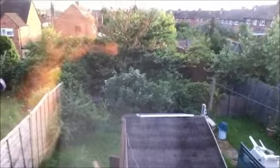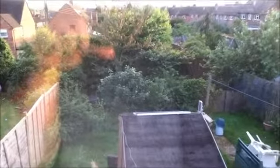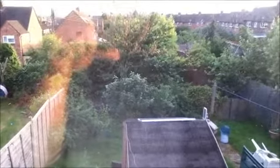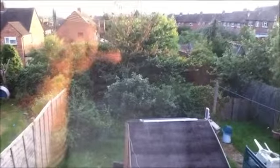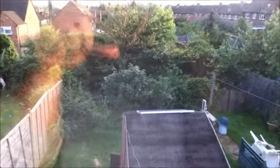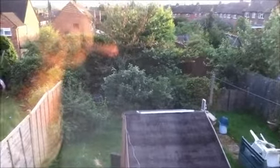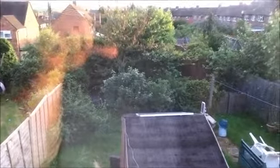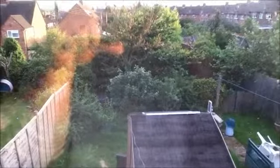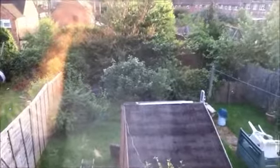Okay everybody, I am inside. Just another point to mention when installing your solar panels: the best location for your panels is a position that faces due south, where your panels will get the maximum exposure to the sunshine, and the angle at which you fix your panels should equal the latitude of your location. So that is that. The next part of my video is about charge controllers.